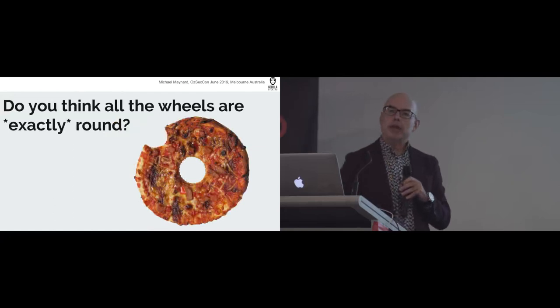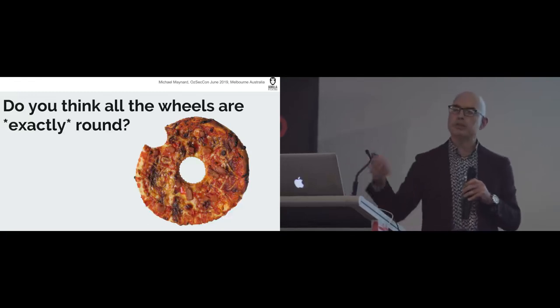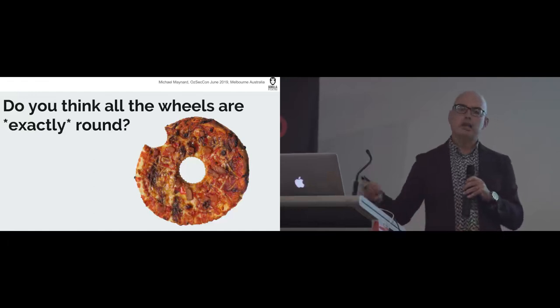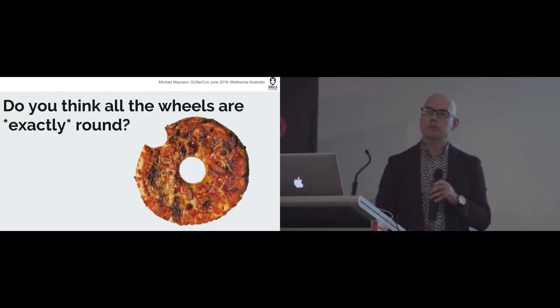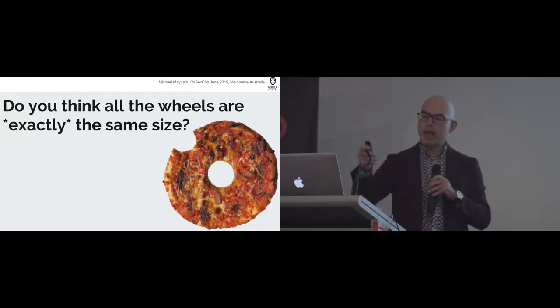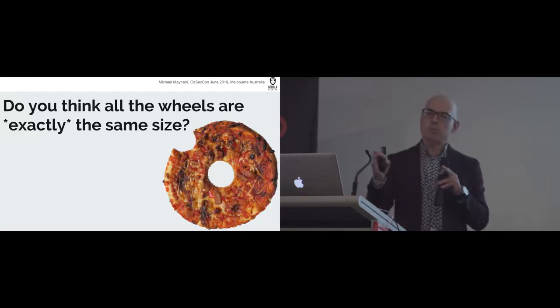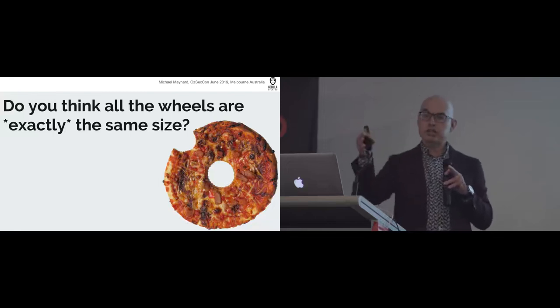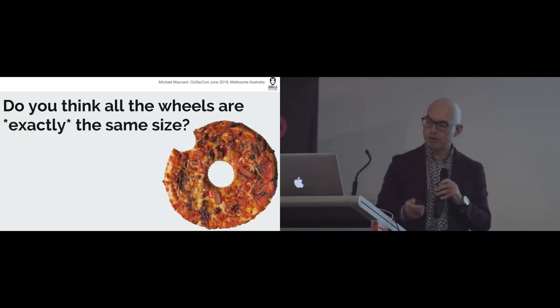let's say you're Sargent & Greenleaf, and you make hundreds of thousands, millions of these things. This is what you do for a living. This is your bread and butter. You sell these things. You are making millions of these units. Now, do you think that every single one of those wheels that comes off the production line is exactly round? I don't know about you, but my pizza wasn't. And the next pizza I buy isn't going to be completely round either. As well as that, do you think they're all exactly the same diameter? They're maybe going to be kind of oval, and maybe one is 10 inches and one is 10.1 inches in diameter or something. So we've got lots of different size variations, but all within the tolerances. So they're good, but they're not perfect.